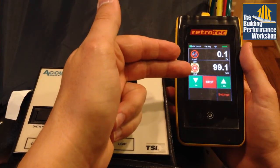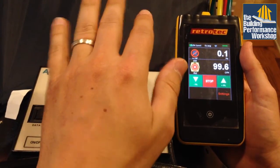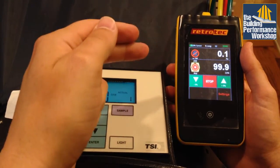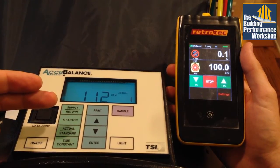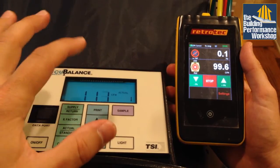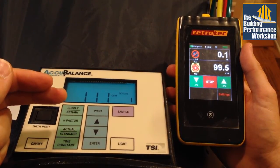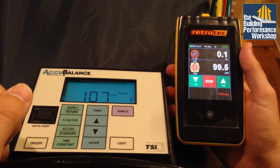If I get my testing fan to run at almost 100 CFM — at each station I'm trying to get within 5% of the goal I'm trying to measure — I can see over here we're still a little high on the flow hood side; it thinks we're about 114 CFM. I'm going to start flashing up what all these numbers mean, and as you can see, these numbers are floating quite a bit. I think the turbulence introduced by my testing fan is making things a bit unstable.